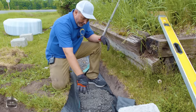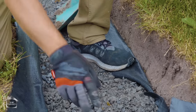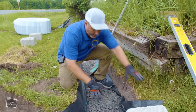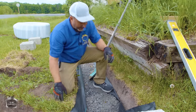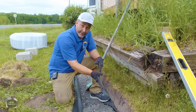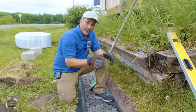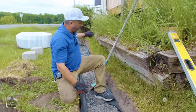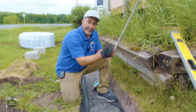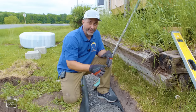It rained overnight and my stone and sand mix is holding all the water — it's pretty dry underneath. That's really important. This is like a water barrier. All the water that collects from the rain comes down, hits this layer, and collects in the weeping tile behind that sock. That is a water diversion system. All the water around the whole building comes down here, gets removed from behind the wall, and that'll preserve the wall's integrity from freezing and thawing cycles and erosion.